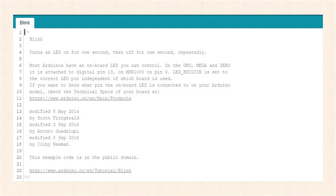Your Arduino sketch snippet in this figure depicts this concept. Notice the comments give a ton of information about the program — what the program does, the hardware, the date it was written, revisions, what pins to use, and other information. You can use comments anywhere in your code, not just the beginning. Though it may be a good idea to include a block of comments like this in your sketches, especially if you're new.